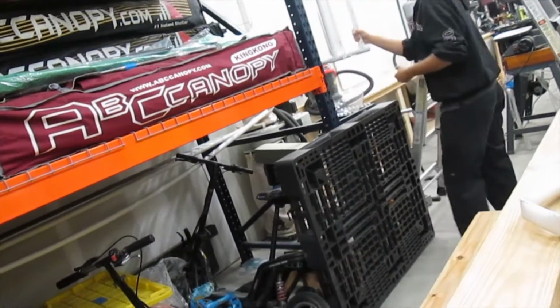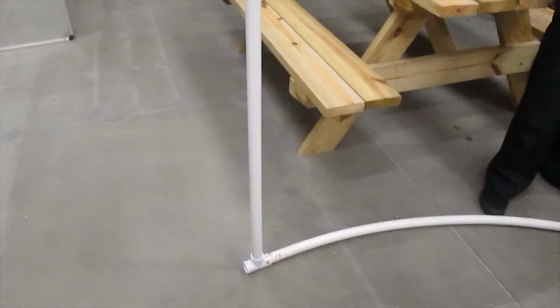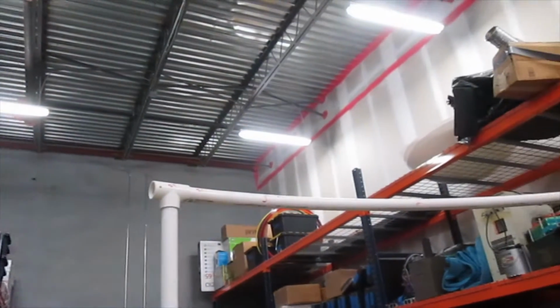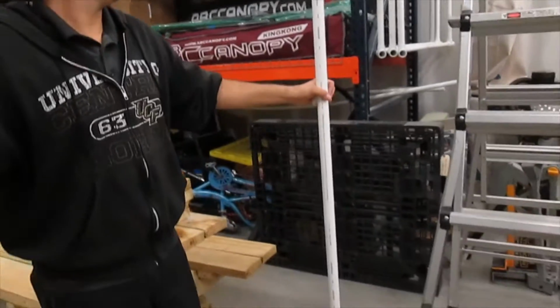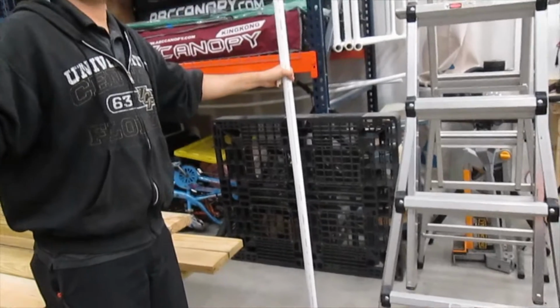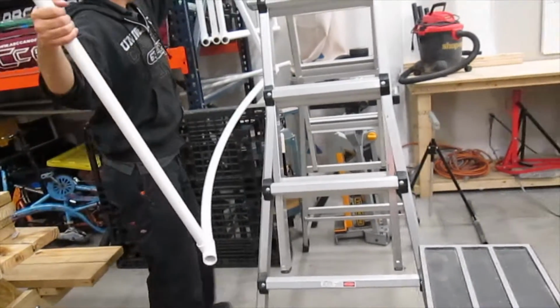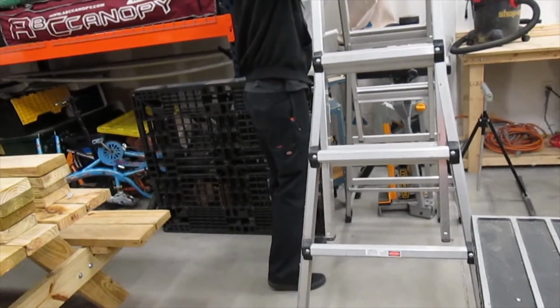But come over here. This is part of our bullet time camera rig. As you can see, we got a nice little curve. We took 8-foot sections of pipe and bent them in a jig to essentially make that shape. And when we assemble all the sides, it's like a 10-foot diameter circle. 24 Raspberry Pis, 24 cameras, all linked together to make a 360 GIF. For you people out there that would say GIF, I say GIF. Well, it's bullet time, right?